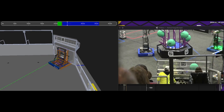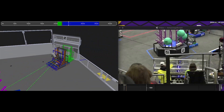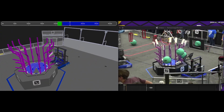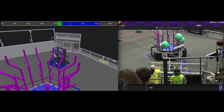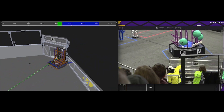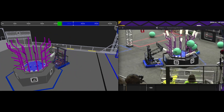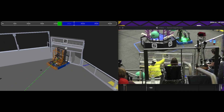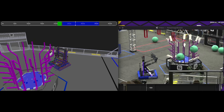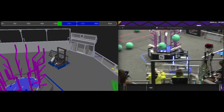That's how we tuned a lot of the measurements and angles before putting them into actual commands — we simmed everything before even running this robot. It was really cool when it first turned on and we tuned all of the PID for the elevator, the arm, and the claw, and it just worked. It's really helpful for making things fast and precise, because if we want to change something, we just write it, sim it, and deploy it.